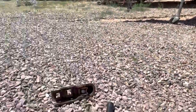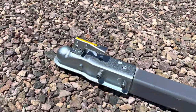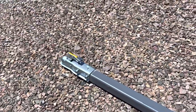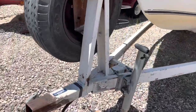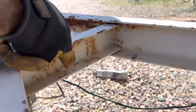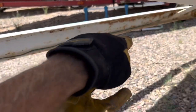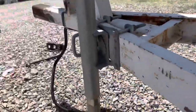The quarter-inch thick tubular steel is supposed to fit inside this two-and-a-half inch tube. What I did is I drilled some holes, stuck the coupler on there, and now I'm going to shove it in and make it come all the way through. I also have to cut a hole in the back with my cutting torch and allow the extra piece to come back in.